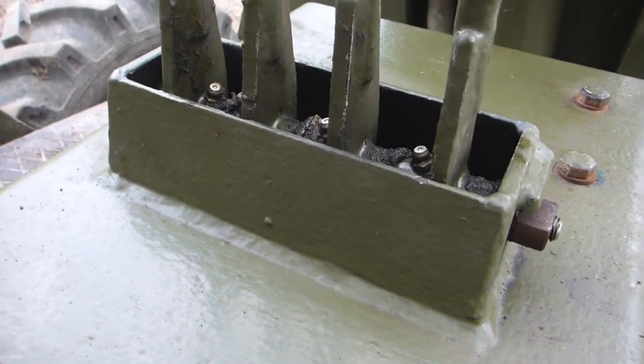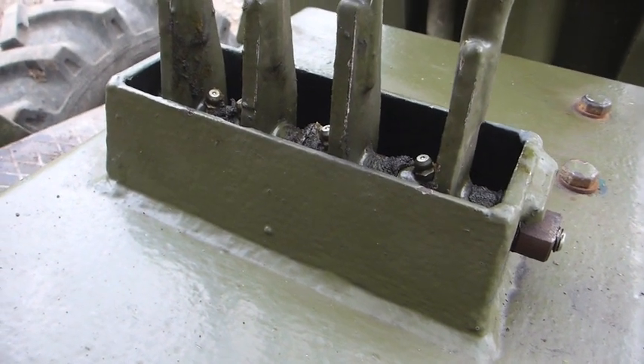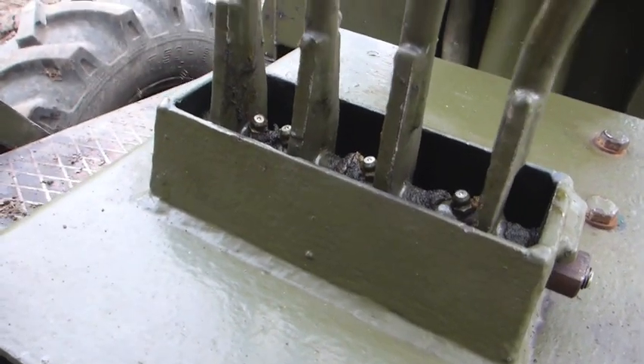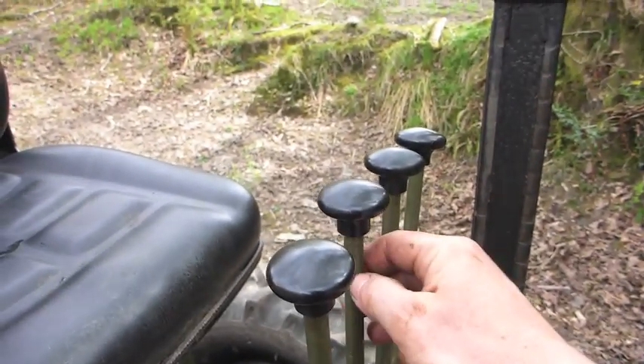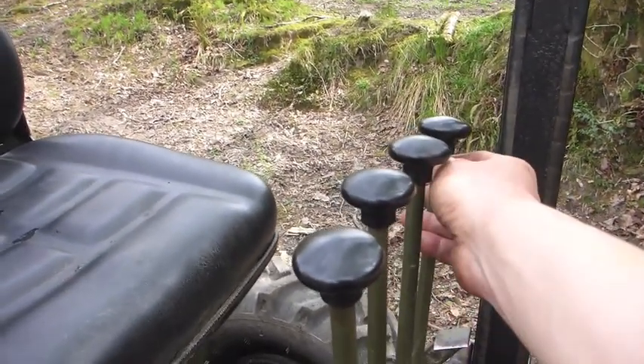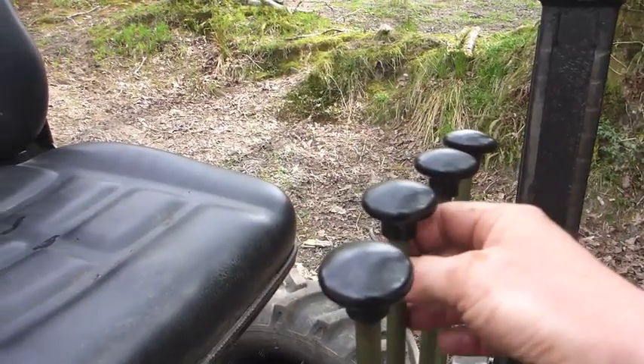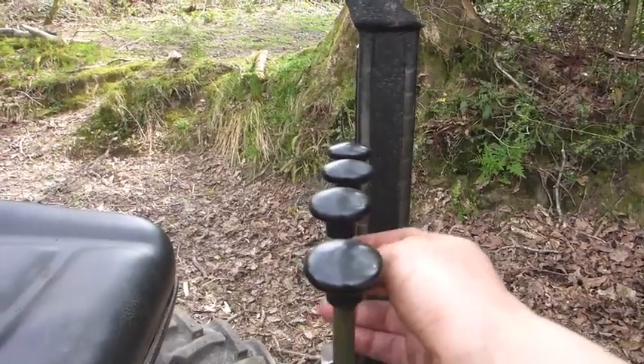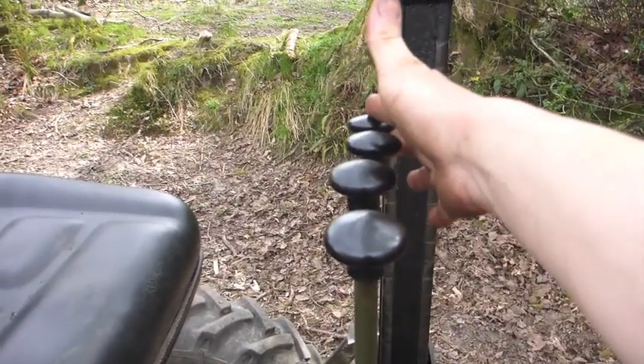I think the original pin diameter on this was... I've run a drill through each of these arms to enlarge them to suit the diameter of the spindle. And now the levers have just the little bit of backlash that tells you that they're all free, but without them being horribly wobbly - it's almost a joy to use.